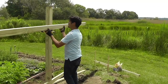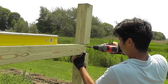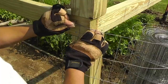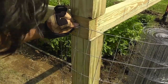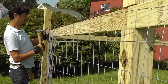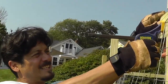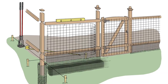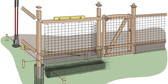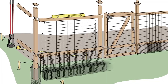Set the rails in the notches and screw them in place. Repeat the process around the perimeter of the fence for the top and bottom rails. Unroll the mesh fencing and hammer galvanized staples every 3 inches to secure the mesh to the top rail. When you reach the next post, pull the mesh taut and staple the mesh vertically to the post every 6 inches. When you reach the bottom of the post, staple the mesh across the bottom rail every 3 inches. Repeat this process along the entire fence and use fencing pliers to trim any mesh that extends beyond the last post.